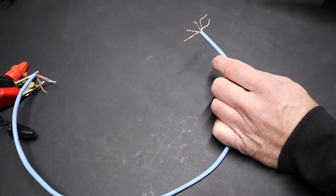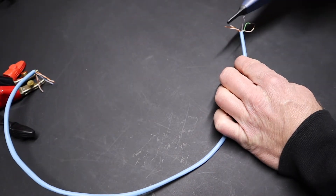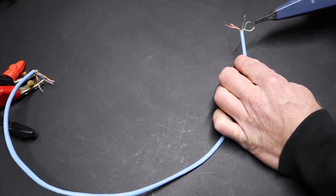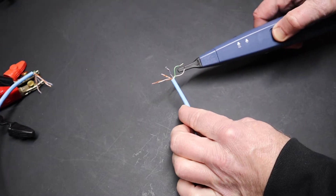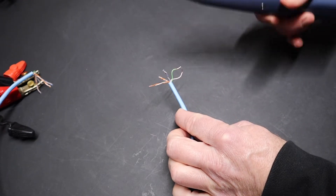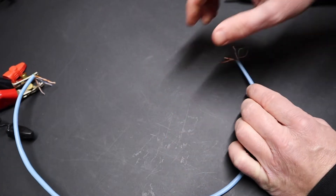I'm going to push the generator off to the side and see if we can pick up this signal. I'm probing around these different wires. You can see it's very loud in the two that I connected the generator to. When I let off the button, it stops sniffing for that signal. So that's, in a nutshell, how they work.